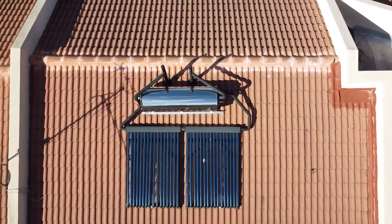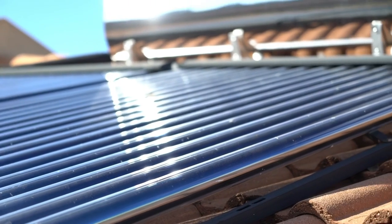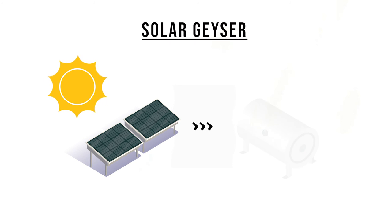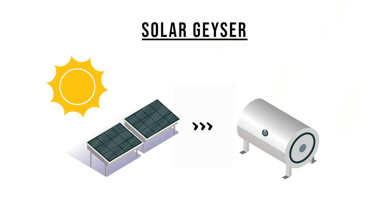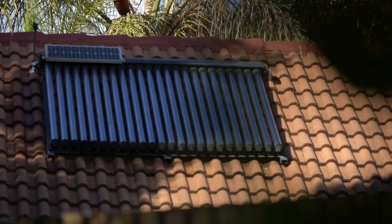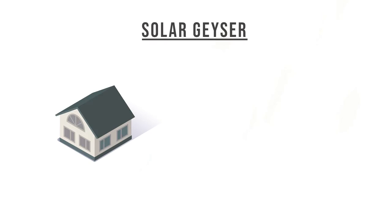The main components in a solar water heating system are the solar collector and the water storage vessel. The collector generates heat from the sun, which is then transferred into the geyser — either naturally, when the geyser sits on top of the roof, or by means of a circulation pump when the geyser is installed inside the roof.